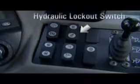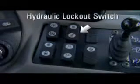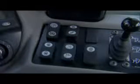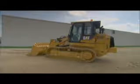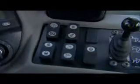The hydraulic lockout switch is next. It's designed to deactivate the hydraulic controls. Press the top of the switch to deactivate the control levers. Deactivate these levers whenever the machine is left unattended. Press the bottom of the switch to activate the hydraulic controls.